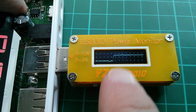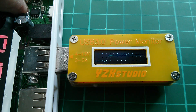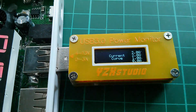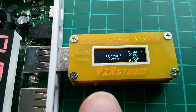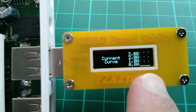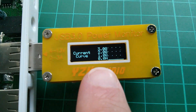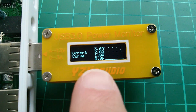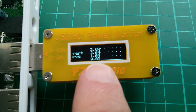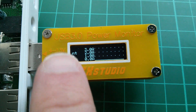There's also a current curve showing how current changes over time. This would be particularly interesting for monitoring a power bank being charged: initially in constant current mode it would show a straight line, then switching to constant voltage mode the current would start to drop, giving a curve going down. I must try that.